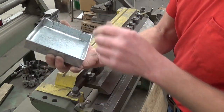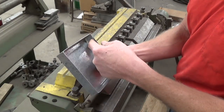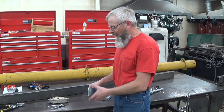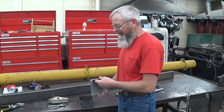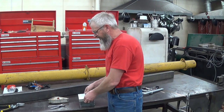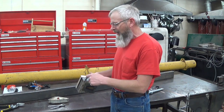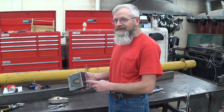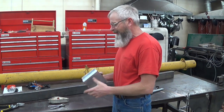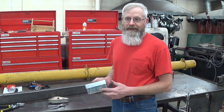We've got a neat little lid. I'll work the corners out with a little hammer and dolly work to get them tight, then take it to a spot welder and give them a zap. I've got my box complete and my lid — spot welded, hammered the sharp corners out, and it fits nice and tight. Tight enough that I have to use a hammer to get it back off, so it's just a good friction fit. Next I'll figure out how to put a hole in the side and get a grommet in there to protect our cables.